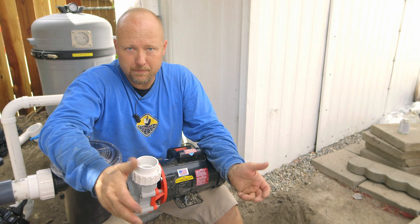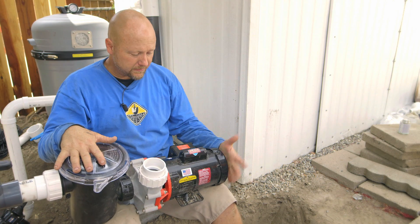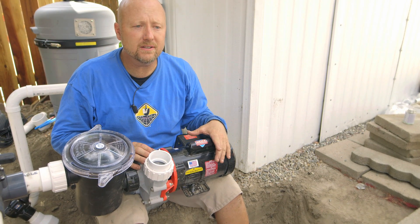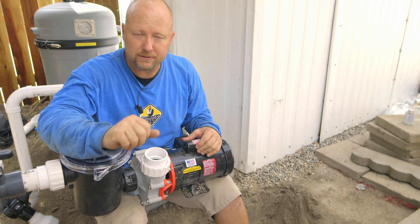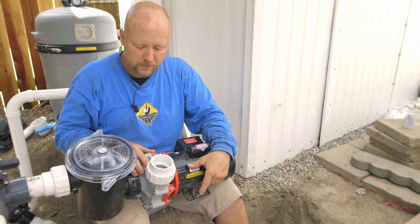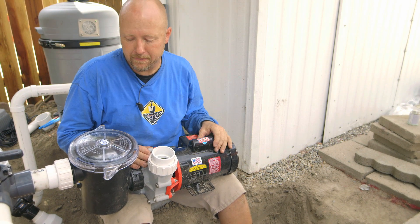It's time to do the installation of the pond pump. I want to tell you a little bit about the pump we chose for this particular installation. It's the Helix external pond pump — we chose a 6800 pump. The pond is approximately 5,000 gallons, and we want to turn the pond about 5,000 gallons an hour, so we had to choose a bigger pump. We're using the 6800 to give us approximately 5,000 gallons an hour turnover on the pond.